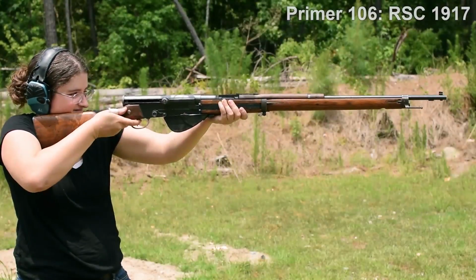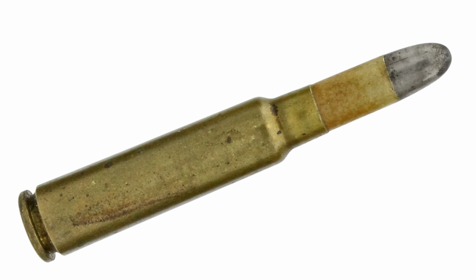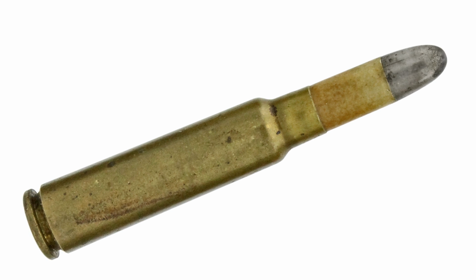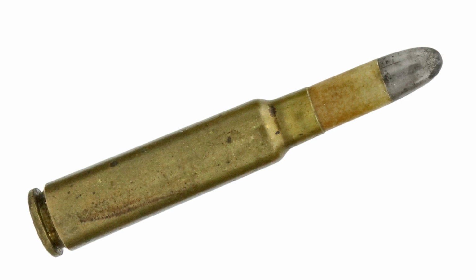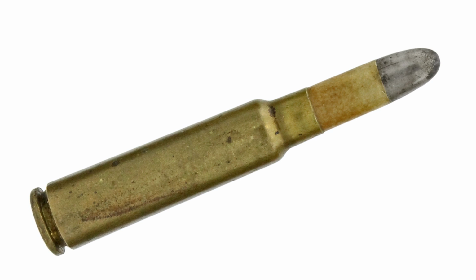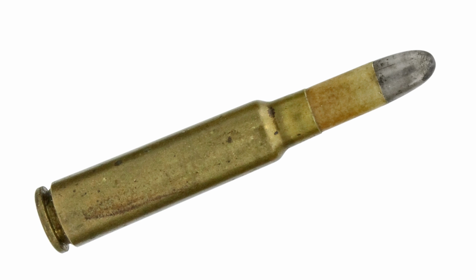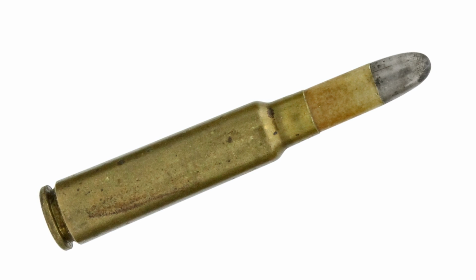Replacing the compressed black powder with the new smokeless actually lowered the pressure curve and likely changed little for the locking action, if anything, on the Swiss rifle. The new powder was also cleaner burning, and this is where we see the Swiss oversight. They kept that greased paper patch when it was now unnecessary.